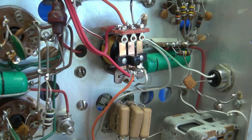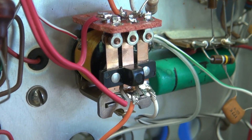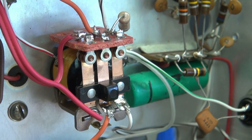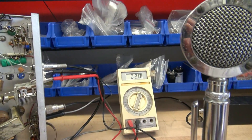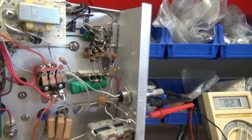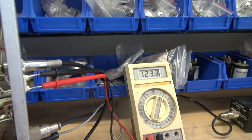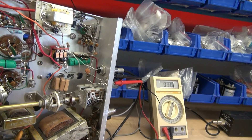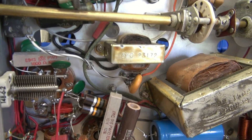When you key it in CW mode, going between standby and CW, you see the relay pulls in and does the work of the original operate switch. Now I've put the Challenger in the phone position with a D104 hooked up. Same thing — it keys the relay, also turns on my TR switch voltage, and then we talk into the mic. Works great.